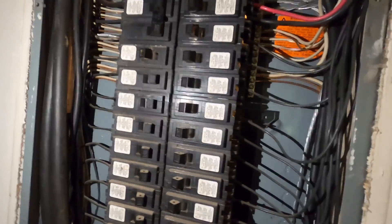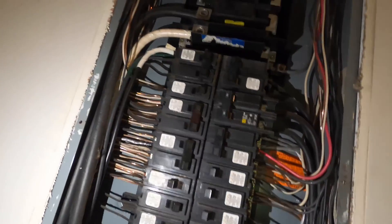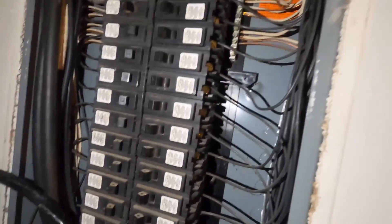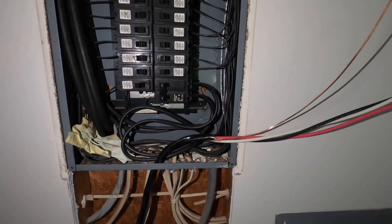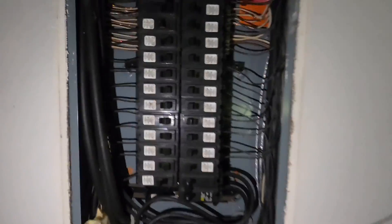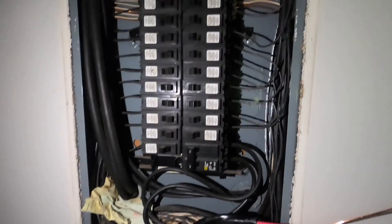Be careful. If you aren't comfortable with this, then don't do it. Make sure you turn off the main circuit breaker — everything in the house should be off if you turn that off, so no power would be supplied to any of this stuff. A big suggestion too: just make sure you get excess wire. I've got these wires separated and I'm going to cut them accordingly to how long I need them to be. Leave yourself excess, especially on this side.